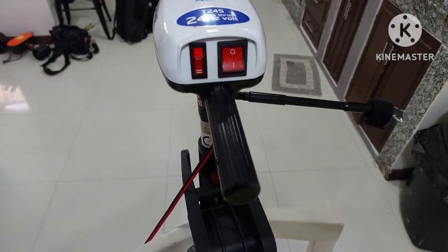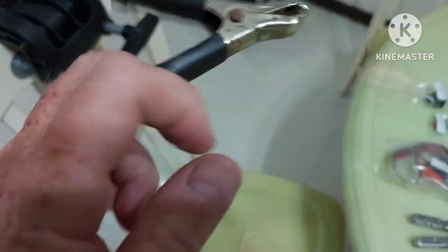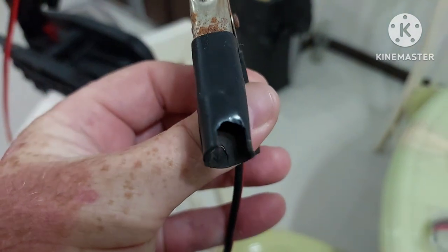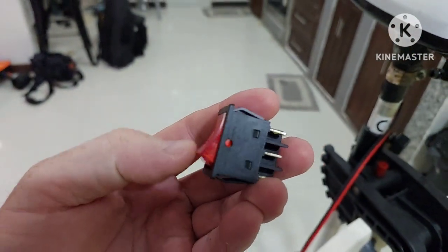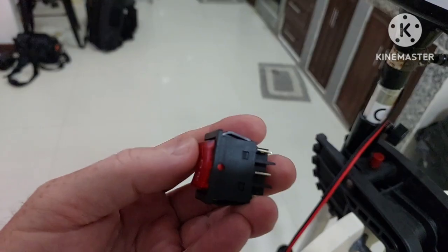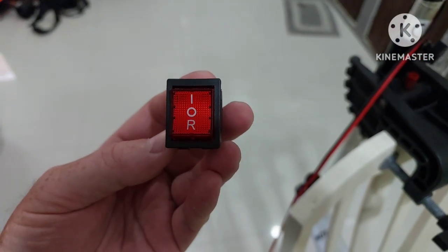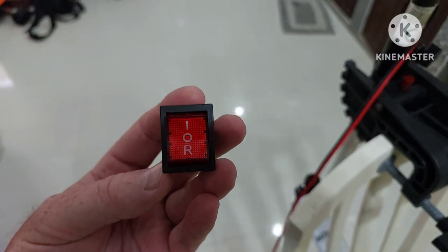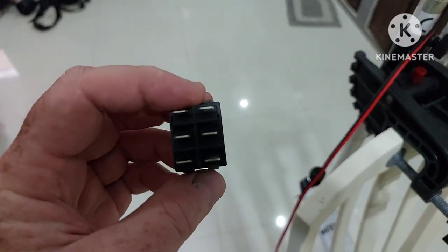One day I was out using it for about 30 minutes and I started smelling smoke coming from my battery box. You can see these melted — the black and red wires started melting. I immediately unplugged it and it turned out the switch had died. The switch has forward, reverse, and it's really tough to get it to stay in reverse. After watching YouTube I thought there might be a capacitor issue, but I contacted Water Snake and they told me there's no capacitor and no fuse inside this motor — something else was wrong. I took it apart and confirmed the switch went bad.